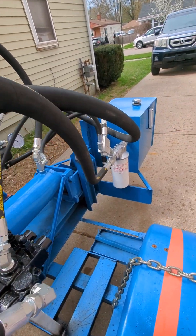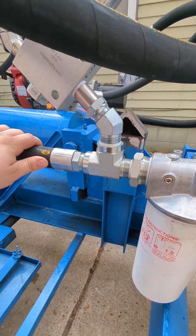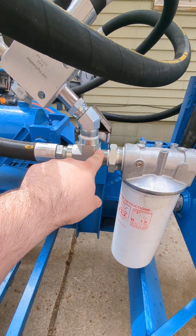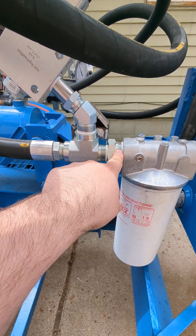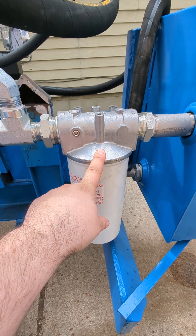Outlet, standard outlet will run a 1-inch line into a 1-inch NPT that goes into a 1-inch-and-a-half down to a 1-inch NPT, so that way I can run an 80-gallon-a-minute filter.